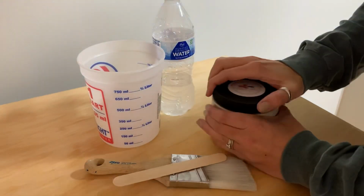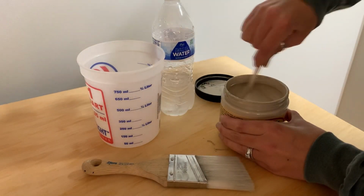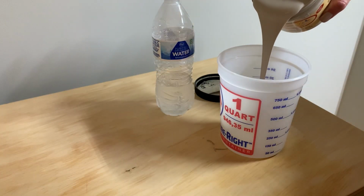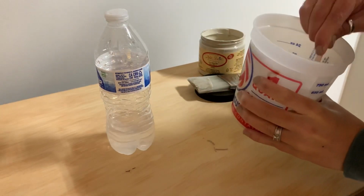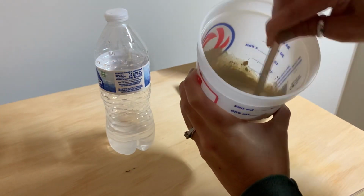We wanted to go with a whitewash on this dresser. And if you've seen us flip the mid-century modern nightstand set, then you've seen us use this technique before. So we're using Dixie Belle's chalk paint in the color Sandbar, and we're mixing it in a 50-50 ratio with water, which thins it out and makes it more like a wash.